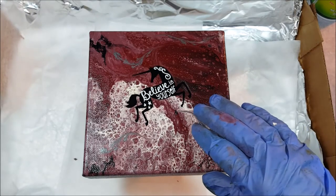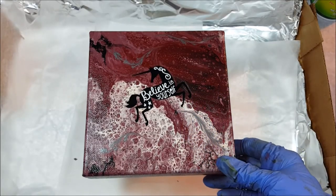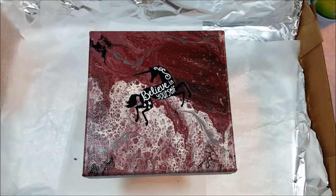And even though I painted this already, it's still kind of porous. A lot of surfaces are. So a sealer is definitely recommended. And certain woods with open grain, such as oak or walnut, will allow air to escape, causing a lot of bubbles in your paint when you're done glazing. So you don't want that either.